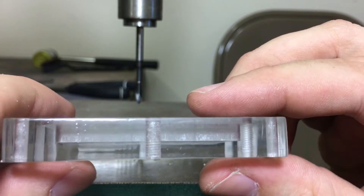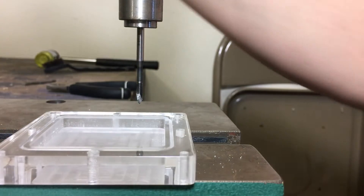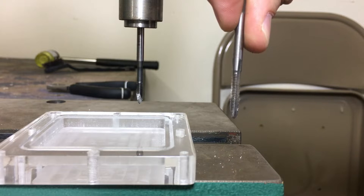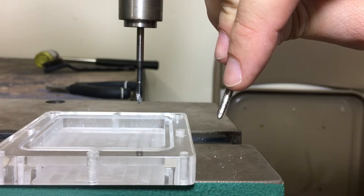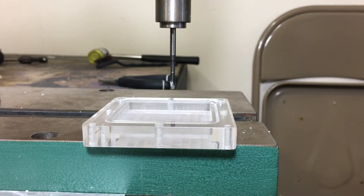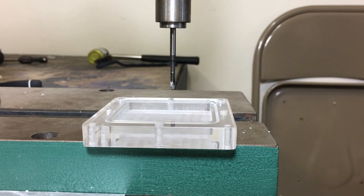Look at that versus the standard tap — that's garbage. You can still see it through the side for a side-by-side comparison. With a standard tap you're supposed to stop and back it out, but when you're doing it with acrylic you can't just back out a quarter turn or even a half or full turn, because although it will break the chips off, they get compressed into those little channels and become thicker than the threading itself — so the threads get compressed out and are no longer usable. Anyway, I searched and searched, couldn't find it, so when I finally found it, it was life-changing. Thanks for watching and I'll catch you in the next one.